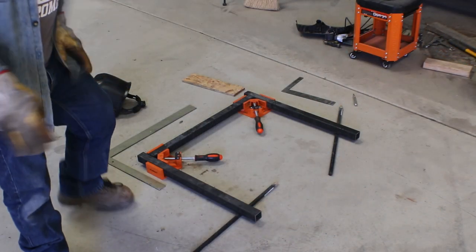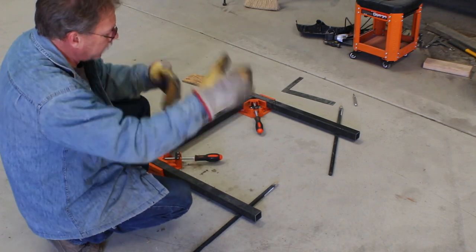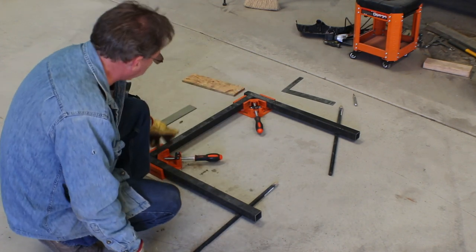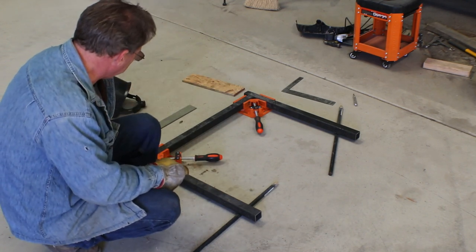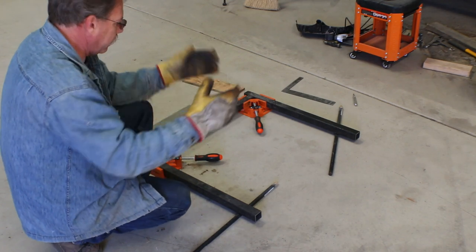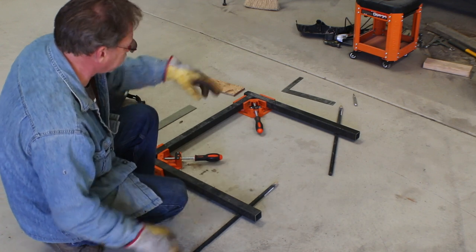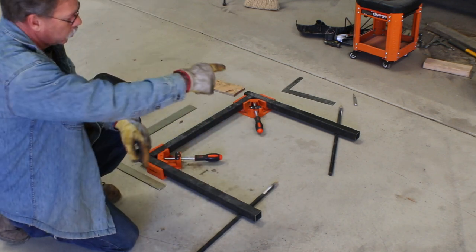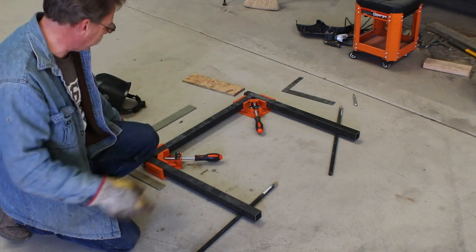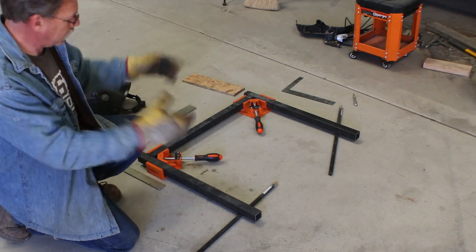I've got the first side laid out. We ended up going from 24 by 24 to a 30 by 30 square table, so that everything will pivot and the arm and saw will open up all the way. This lower leg will create a shelf and I'm going to space it up one inch from the end of the legs. Due to the depth of the DeWalt saw being three and a half inches, and the casters being six and a half inches, we end up with a 26-inch leg for the table. The top rails are 30 inches with 45-degree miters, and the side pieces are square cut inside.